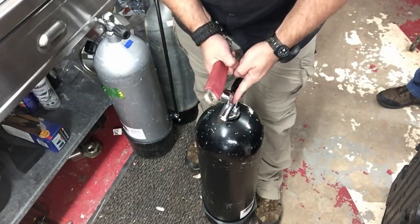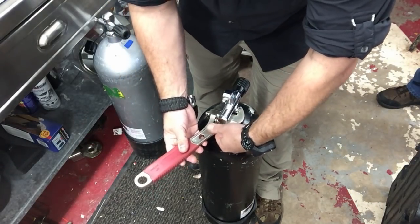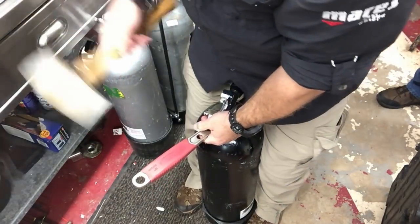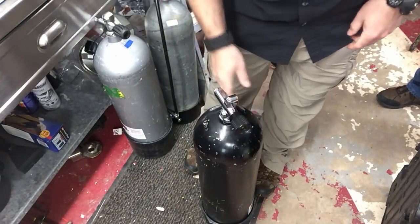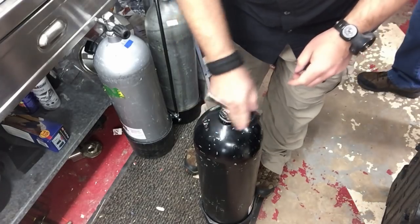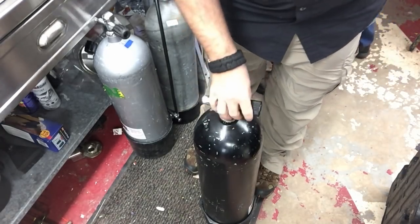This valve has two flat spots, and if you have a rounded neck on your valve you can use the flat spots up top as well. I'm going to take my adjustable wrench, fit it to the flat spot, and pop on it until it breaks free. Once it breaks free, I can very easily just screw the valve off without any damage. At this point I'll hand it over to Troy and let him do the visual inspection.